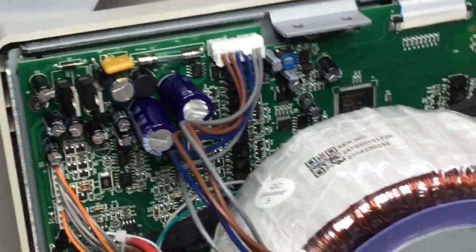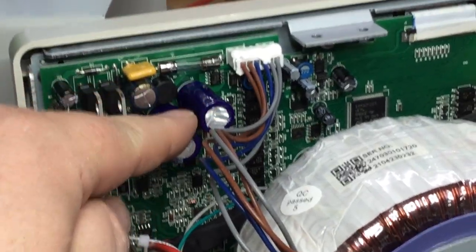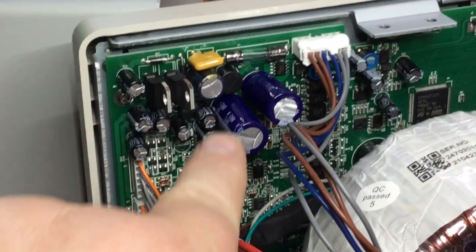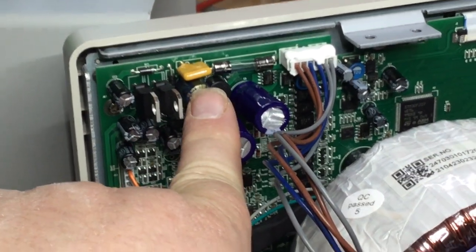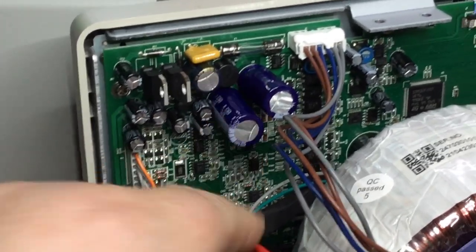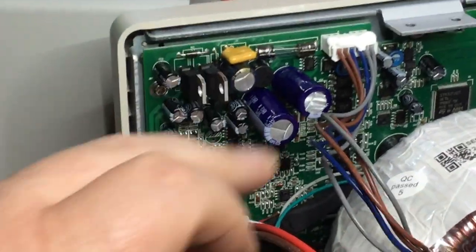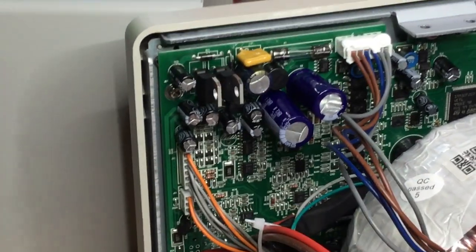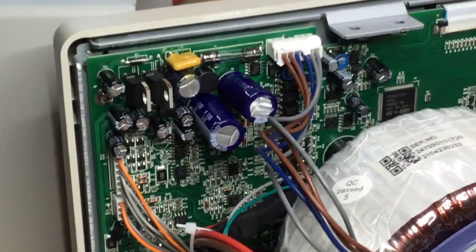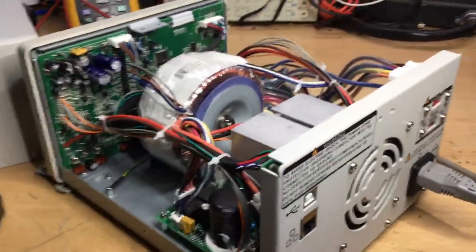So I think what's happened is the heat conducting from that, because of its close proximity, it's snugged up against these capacitors, is probably sweating those caps out, and likewise this 35 volt 220 microfarad capacitor is wedged up against it. Had there been a bit more space in between all these components, chances are it wouldn't sweat these out. So that's standard sort of thing that happens with these capacitors. Anyway, we'll see what happens.